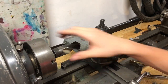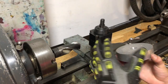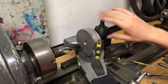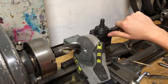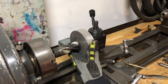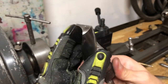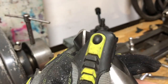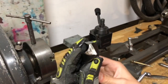I've just put the lathe into back gear at a super low RPM — hopefully it'll run that. Don't wear gloves; I'm just doing this because the part is so hot I can't really hold onto it, and the lathe is at a slow enough speed where I'll have enough time to react if anything gets caught. But yeah, don't do this. Upon closer inspection, it appears that this drill bit was sharpened by a monkey — there is absolutely zero clearance behind the cutting edges. That is why you don't buy second hand. Nothing to do now but resharpen it.